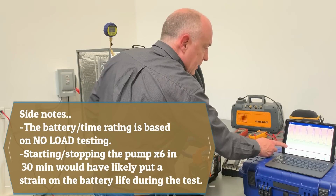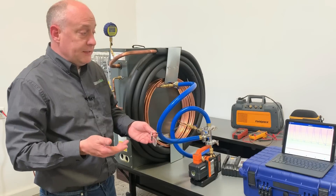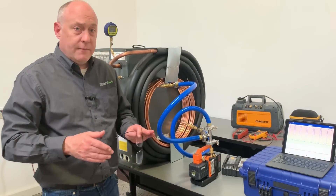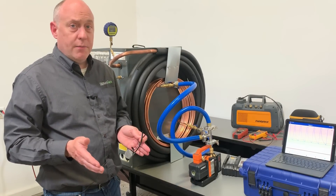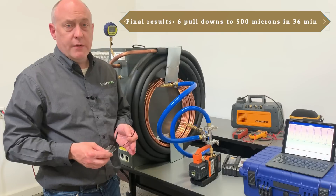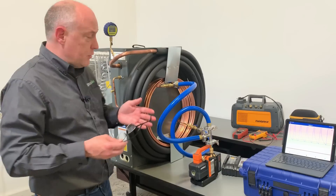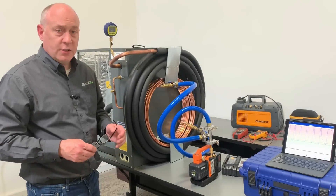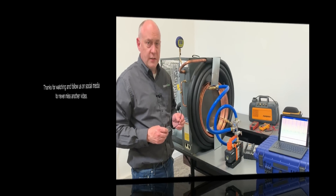And we're at six times at roughly 36 minutes right here. So 36 minutes in — and I've been talking a couple minutes — so about 30 minutes to pull down the system six times, right until the battery was dead. It's really quite impressive that we could do this with this little battery pump, and it just shows you how valid this type of technology is. I would have never believed we could do it six times. And we never could have done this with quarter-inch hoses — that's really what makes this thing unique. You've got a pump that's so light you can pick it up and carry it in your pocket almost. It's a great little pump. This is Jim Bergman with MeasureQuick — thanks a lot for watching.